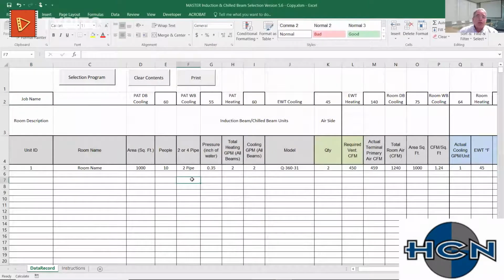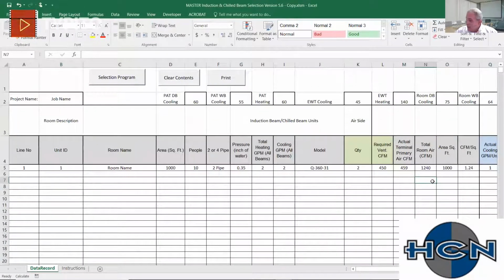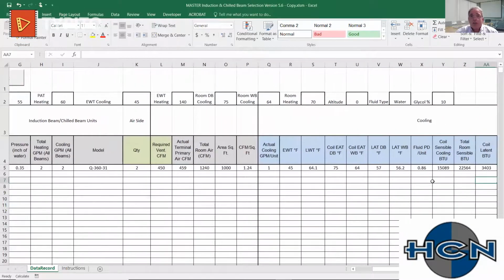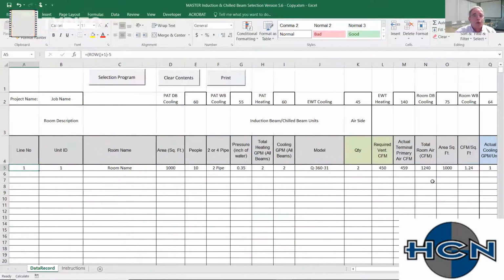And in our schedule, we give you more information than the average chilled beam manufacturer because other manufacturers don't deal with the latent capacity. They let the engineer worry about the latent in their primary air, and they don't want to talk about it even. But because we're a condensing system, we're going to show you under these conditions just how much condensation we're producing. So for those 2 4x4 units, we're producing 0.4 gallons an hour. That's kind of what I'm talking about, the almost absurdity of some of these designs to avoid small amounts of water in each space.